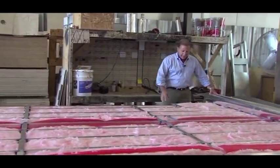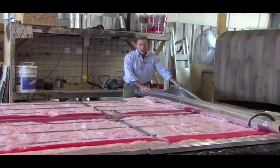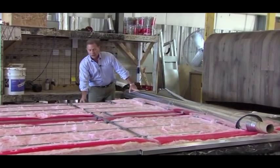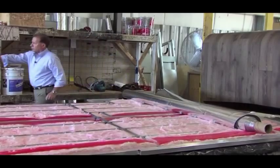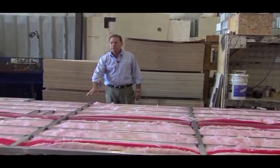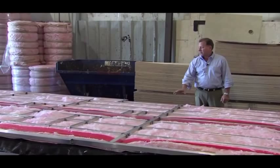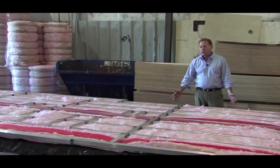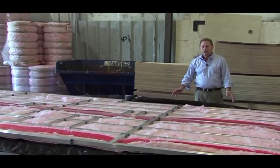In this floor, you're going to have your fiberglass insulation, your calculated reflective foil at R38 calculation, and then your Darco underneath that to protect from moisture. Then on top of that, we're going to put plywood decking on top of this floor. We don't use OSB. Most of our competitors are using chipboard or OSB board for their flooring, which is very heavy. And Open Range is about more room, less weight. So we take out weight anywhere we can, not compromising structural integrity.